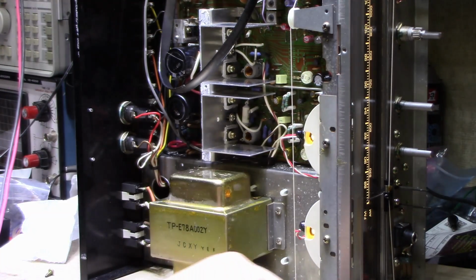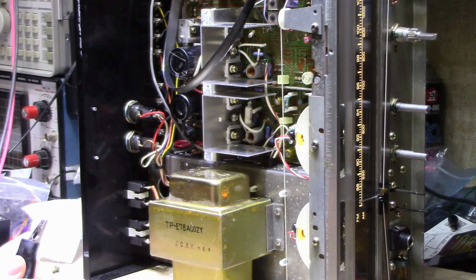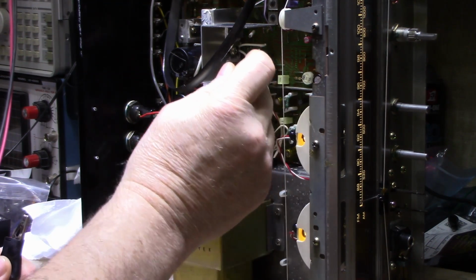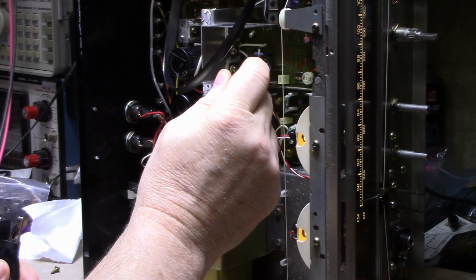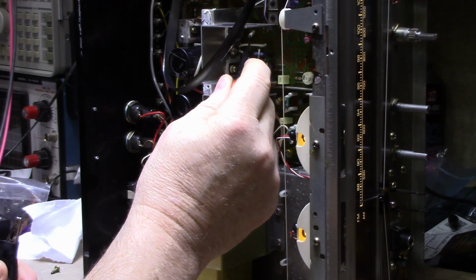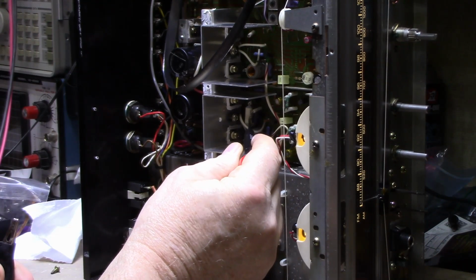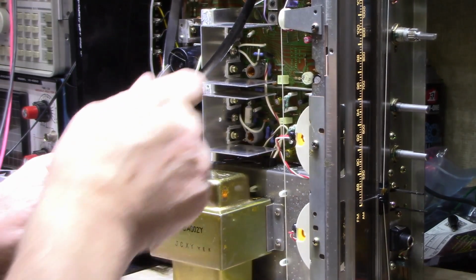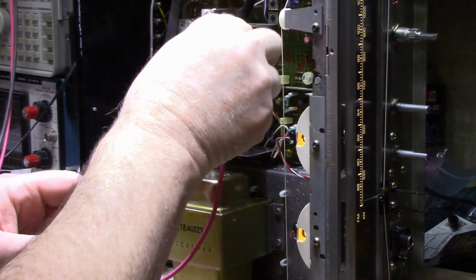There are 2 points on each amplifier. You can see them on the camera. I can zoom in maybe. I'll point them out to you. There is one here. There's one here. It's behind the coil, and it's like a white ceramic post with a little curl on top. Here's another one. Those are your 2 test points, and then there's one here beside the resistor, and then one buried underneath here behind the coil. You just clip your voltmeter to these 2 ends, and the manufacturer spec is 40 millivolts.